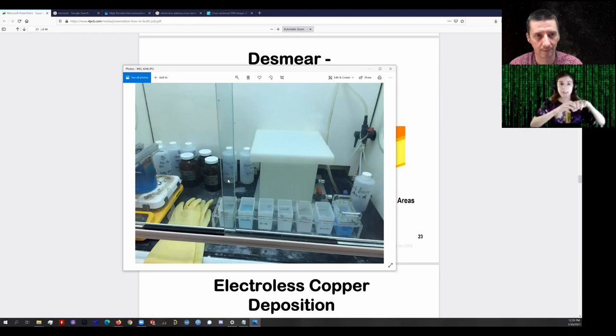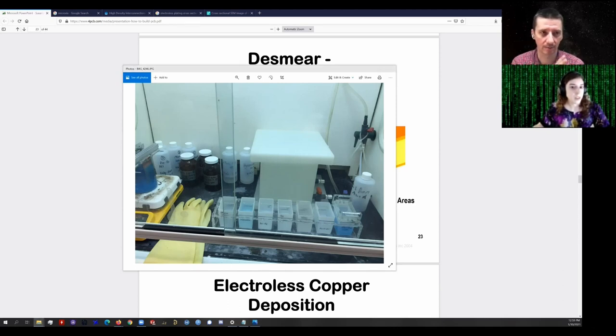It's actually quite satisfying. Then the tin — will it not stick to the copper surface? Will it only stick to the resin? No, the tin does not in any appreciable quantity adhere to the copper at all. So it will basically be only inside the vias? Only inside the vias. The silver, though, has a higher redox potential than copper, so the silver will still adhere to the copper. So that's why all the other surfaces will also turn gray — yeah, the whole board turns gray quite quickly. But the holes in particular go from being fiberglass, sort of yellow-brown in color, to gray, because there's silver depositing.